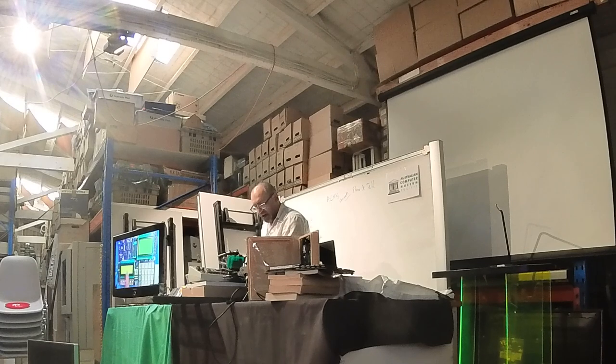So instead of loading this A hard coded to G, what I'll do is I'll do 06, which is load B register, with 00. And now I need to load B to A, but I need a space there. So what I can do is at this particular location, I can do function and plus. Yes. And I'll actually insert a byte. Now it's done a no op in that particular location.